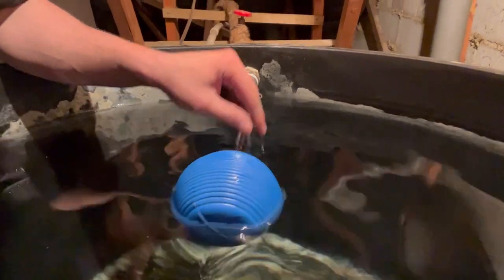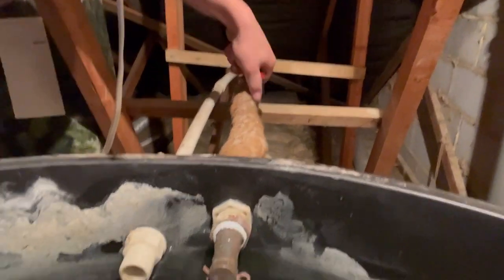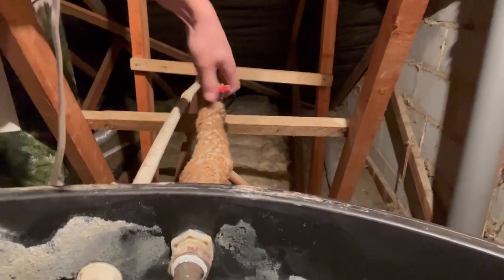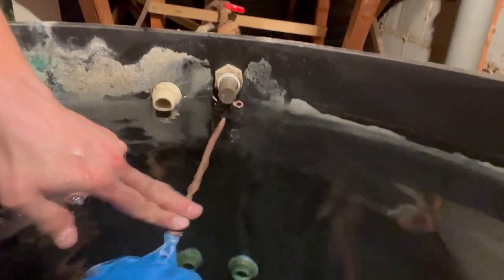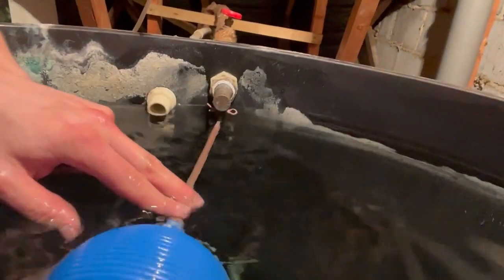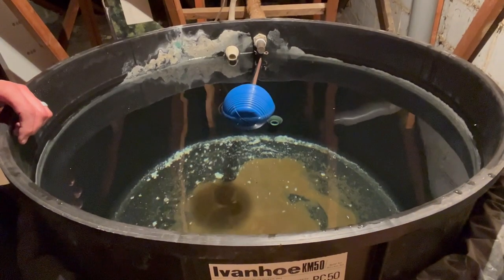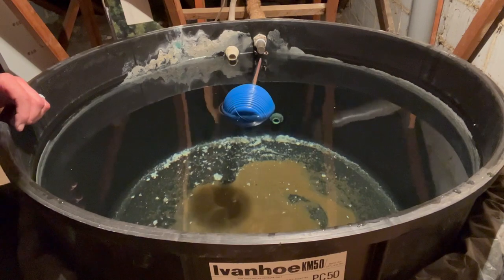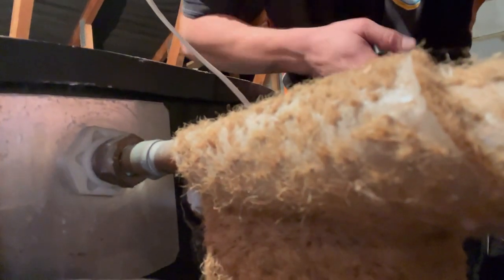I'm going to isolate the water, which is easy to do on this tank — it's just a matter of turning this valve. Just make sure you are isolating the water in some way if you are going to replace this valve. If you can't find any way to isolate the valve in the roof space, then you could turn off the water main to the property.